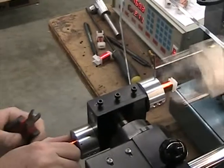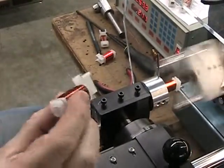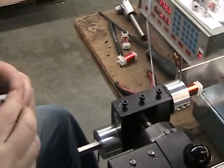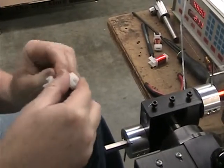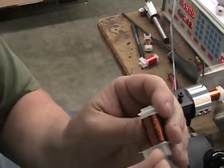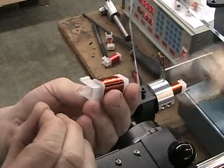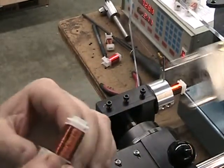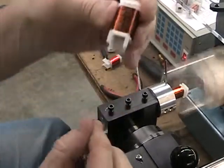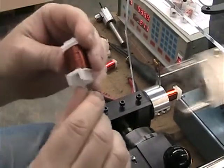Now that the second one has started turning, I can cut the lead wire and pull the first one off — a little tight there because the wire compressed it. This probably should have been taped before I took it off, but you can see how the inside wire goes right through that slot, just by the way I laid out the winding. Then the other wire I can bring to this other slot, so there are the two wires.